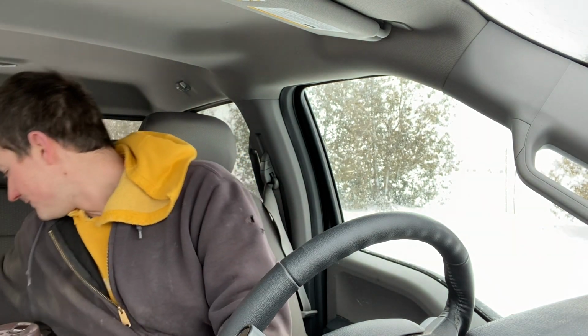I did get, let me see here. Oh, that's not the right one. Here's the right one. We've got chain links for that gutter cleaner. What we're going to do is slice it with a grinder, cut one of the links out, shorten it up to the right length, and then put one of those connector links in, put it back together, and away it'll go for the next several months before we'll have to tighten it again. So that won't be too hard of a job. We'll do that this afternoon after lunch.